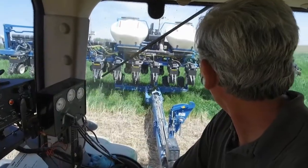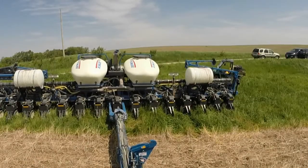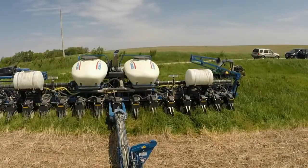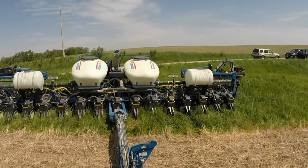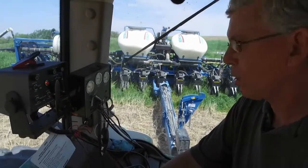Safety hitches are off. Down she comes. In just a second I will do a hydraulic wing unlock. There — you can see it's released the two wings, so now the wings will float. Raise her back up. She's in field-ready-to-go mode, almost.